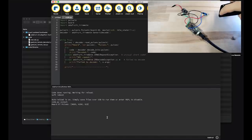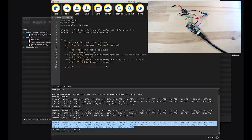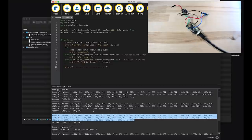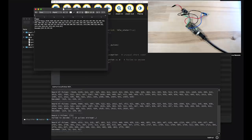Now take your remote, point it at the receiver, and press a button. Hopefully you'll see a bunch of numbers pop up. The first set is the raw infrared pulses that it saw, which represents how long it saw the infrared LED on and the pause before it saw it again — it alternates in pairs like that. The second set of numbers is the actual decoded values that those infrared pulses were sending. Think of it like the difference between the individual sounds that make up words versus the actual understood meaning behind those sounds. That's why you'll see some slight variation between two presses of the same button for the raw values, but the decoded values should remain the same. Copy and paste both of those into a text editor for every button that you're going to want to use.